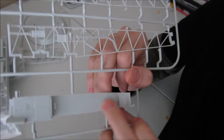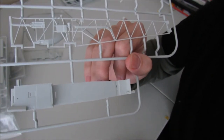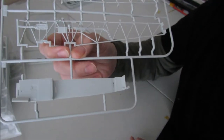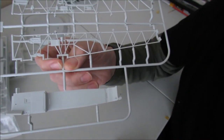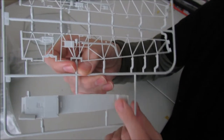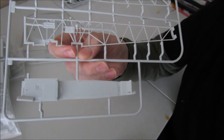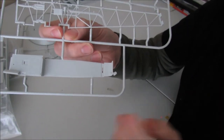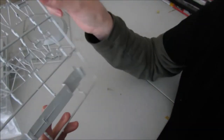I don't know whether that's been done by Moldtech, which is a company that does textures for the moulding industries, and they have hundreds of different textures that they can photo etch when they apply textures to injection molded parts, or they just did it with their EDM settings. You can do certain textures using your EDM settings on your EDM machines. But that looks very crisp, very nice.